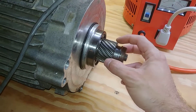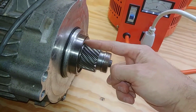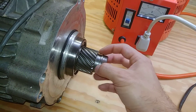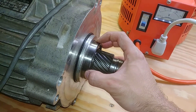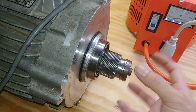When you go into regen or reverse the same thing happens but the thrust is in the opposite direction. So you accelerate, then regen, accelerate, regen — do that over thousands of miles and it causes these bearings to kind of wallow out. You get a lot of axial play that you shouldn't have.